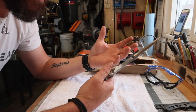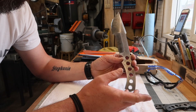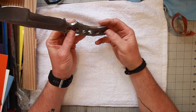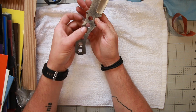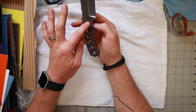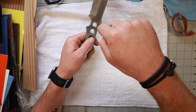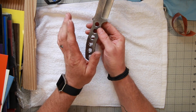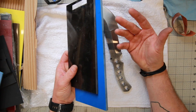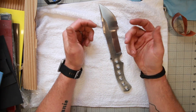It's going to be really hard to line up proper places for the pins when I don't have anything here. So what I'm going to do is take pieces of aluminum bar stock and machine a little insert that will fit in here — a nice precise locating fit, maybe three of them — and then drill and tap those little spacers so I can screw on some scales. That's why I believe I need to use synthetic material: I don't want to be tightening fasteners into wood. I have great wood, but for this one I really want it to be synthetic because it's stronger.